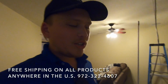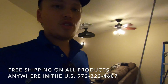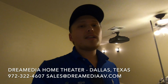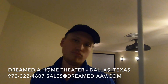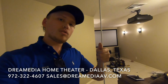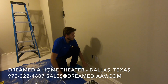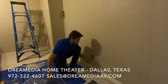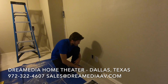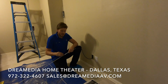All right, guys, the time has come. We gotta get this subline here down to here. I'm gonna just try to follow the path of the Romex that was coming down here, but if that's not the case, I'm just gonna use my handy drill and a fish rod, just send it down the old-fashioned way. Cool. Pull. And that's our subline. We're good.